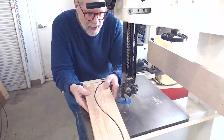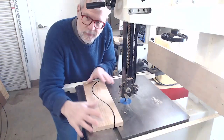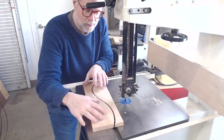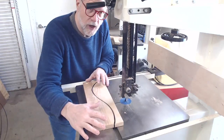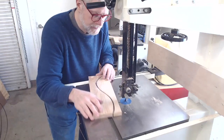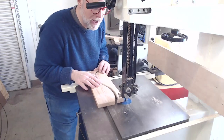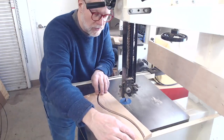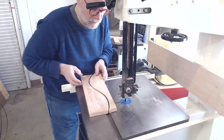A couple of things about making curved cuts: you'll need to move your hands around while cutting to keep them in a good position. Generally, if your hands are farther apart you have finer control over the movement of the board as you guide it through the cut. Sometimes you start with both hands behind the blade, and then as you make the cut you can move a hand to the other side of the blade and continue that way.